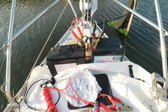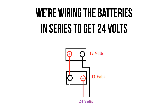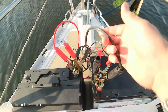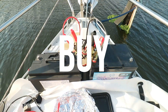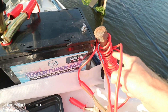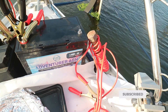How do we set this up then? Well it's a piece of cake. All we've got to do is connect the positive from one battery to the negative of the other. In my case I've doubled up the cables so there are two sets going to each connection, but the only reason for that is that the cross-sectional area of these is tiny because they're very cheap — if you've got decent jump leads you only need one cable. I've also made up an inductor here, just a big steel bolt with some coils around it. With the jump leads you don't actually need that — you can weld without it — I've just found that the arc is a little bit better with it in there.